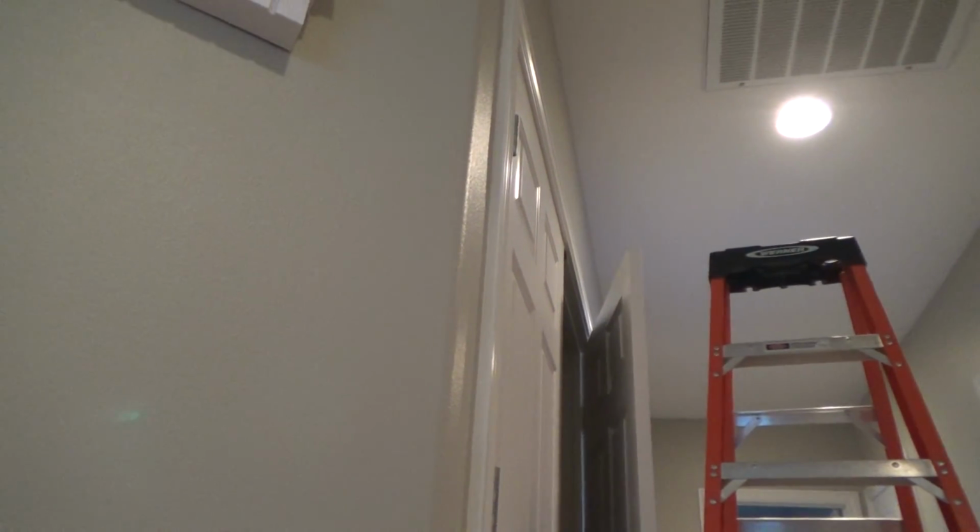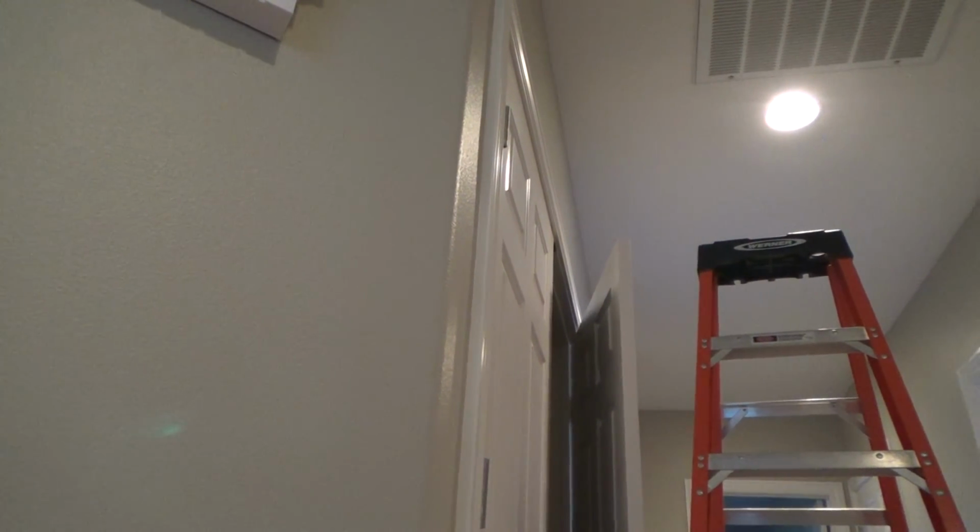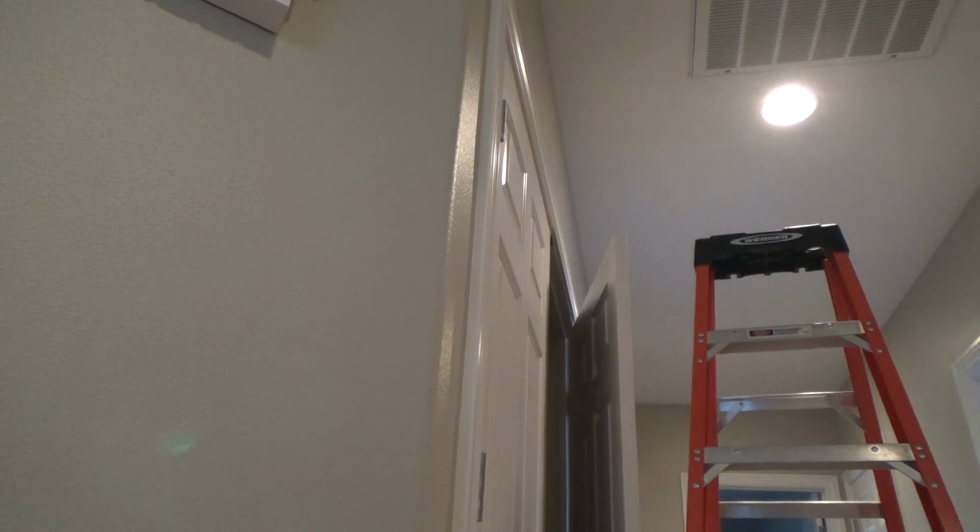But I don't countersink many nails anymore. I used to put on trim like this years ago. Before they had nail guns, you'd have to do it all by hand with 4-penny nails, 6-penny finish nails, and 8s and stuff. Then you take the little nail sets and then tap, tap, tap. It goes in there and then you fill it up with caulking putty and so forth.